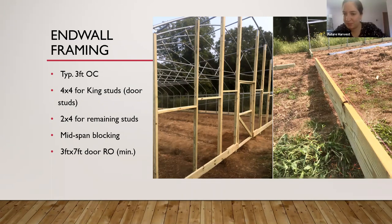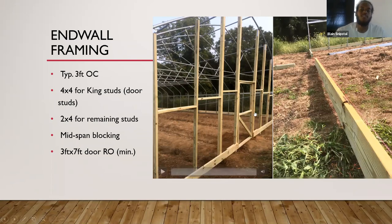And we have a question about what is a rolling barn door. Could you describe that really quickly? Yeah, so this type of door here is called a barn door, categorically speaking, and it's hinged or hung, which means that it's going to open like so. That same door, if we were to mount it on the face of the tunnel or on the interior of the tunnel, will slide on rollers, usually called a cannonball track system. And that's a sliding barn door.